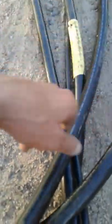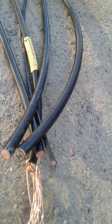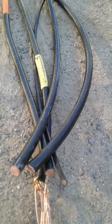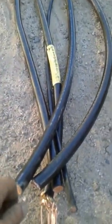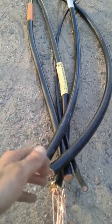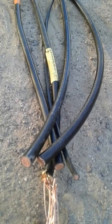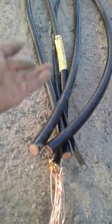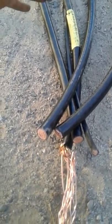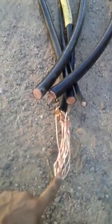Then you turn your roll around again and roll it the right way around. What that does is it makes it so the sticky sides stick together. When you go to cut the tape off of the wires, it just comes off in one big sheath — it doesn't stick to the wires, it all comes off in one nice piece when you finally pull it through. It does help to have all that tape around there for that foot and a half, and to have all these wires connected to the rope itself.